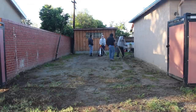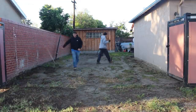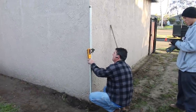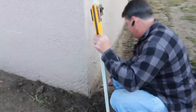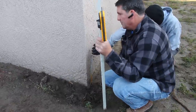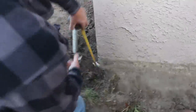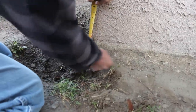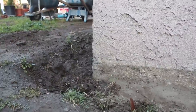I'm cleaning along the edges so I can actually snap the line on the walls. I found my low point to start with, which was the back patio. From that point I need to get the water to slope to the front yard. Everything else I do from there will be lower, and that's how I know it'll be sloping out correctly.